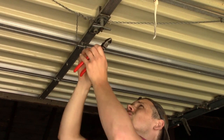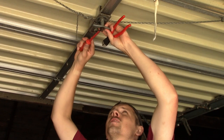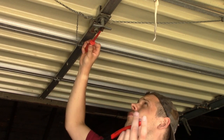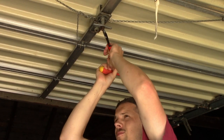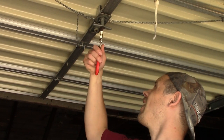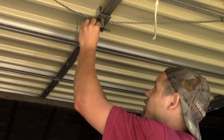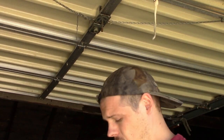I'm going to try and do this with that — but that doesn't work because I can't reach in there. Okay, I got some space in there now with the screwdriver on the back side, and I should have enough where I can cut it. And there we go. Now, depending on the quality of the tools you have, you may not want to use a pair of wire cutters on this. I have some very high quality Knipex, and you can actually use the wire cutters to cut finish nails and it won't hurt them. I've seen it demoed and I've actually done it personally.